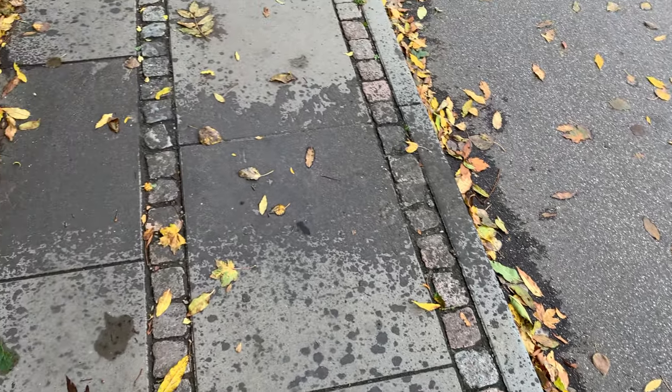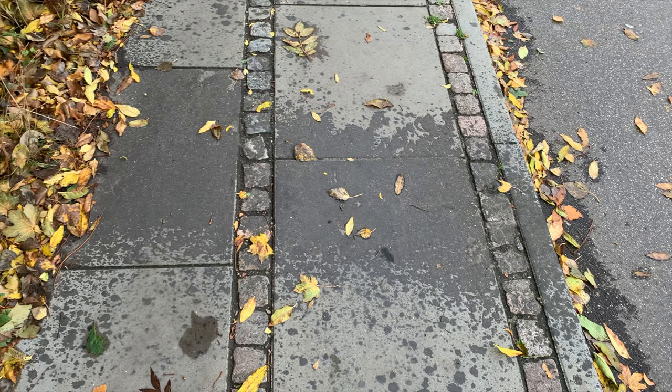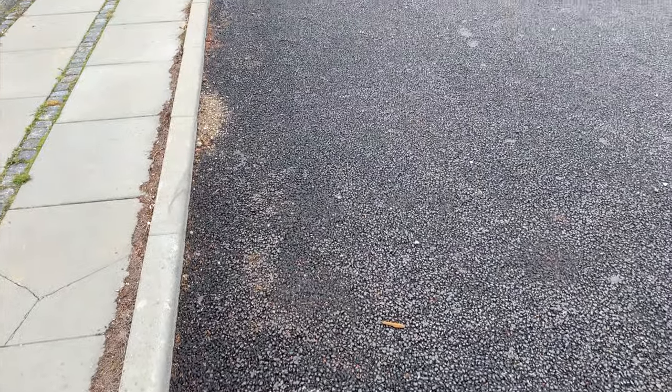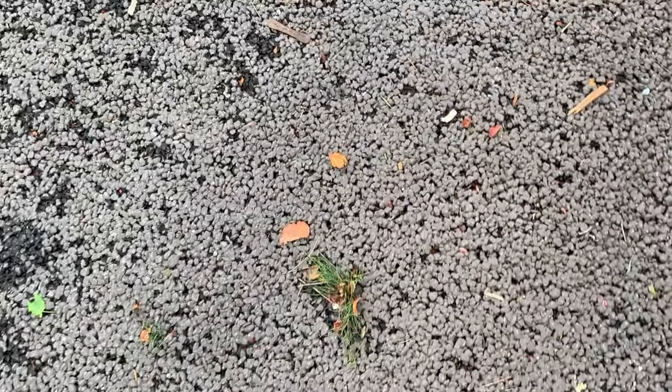Another failure to avoid is damaging tiles around the pour with the primer — this is a costly failure, definitely worth mentioning since it costs money to repair and is unwashable. For the last fail we will mention: proper weed control. As you can see in this case, the weed control was not done properly and a lot of horsetail is growing through the asphalt.